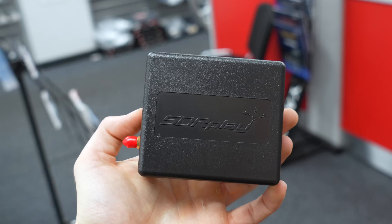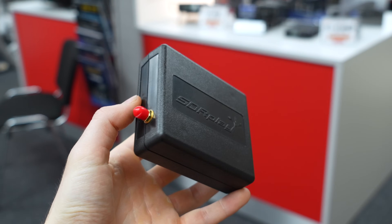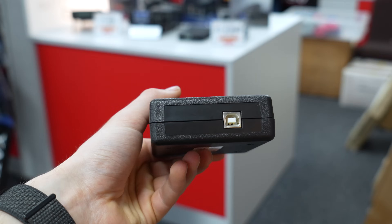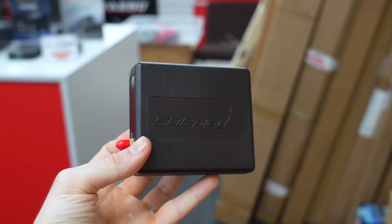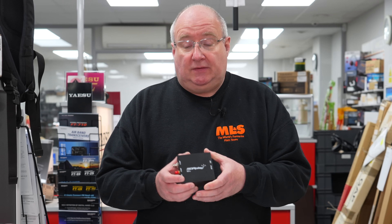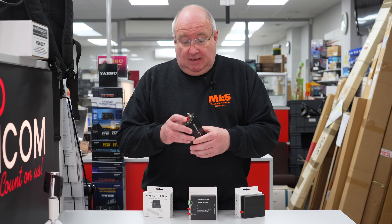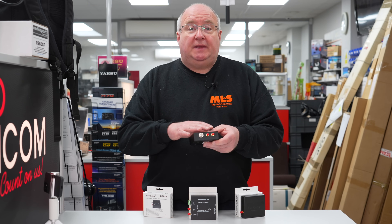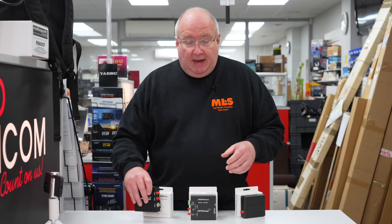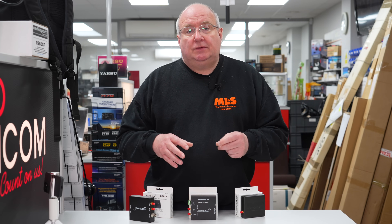Now, who is this for? This is really intended for radio shortwave listeners and various VHF/UHF listeners, schools, colleges, education — that sort of thing. Maybe even venturing into government use. These are just receivers, not transmitters. They're incredibly good — they go from one kilohertz right the way up to two gigahertz, and some even have two receivers built in that allow diversity.